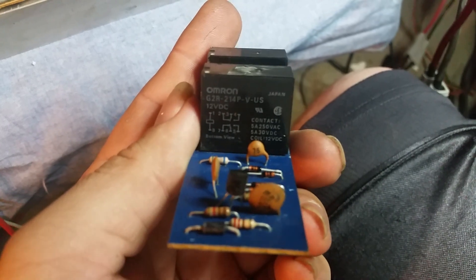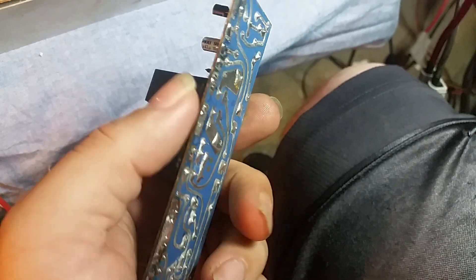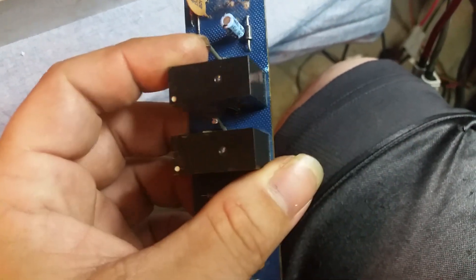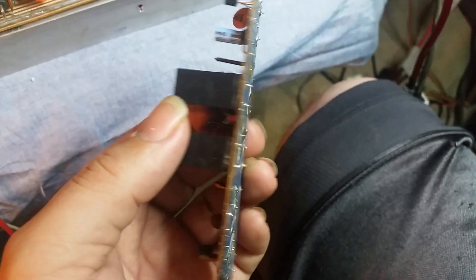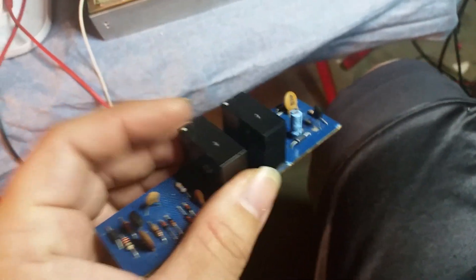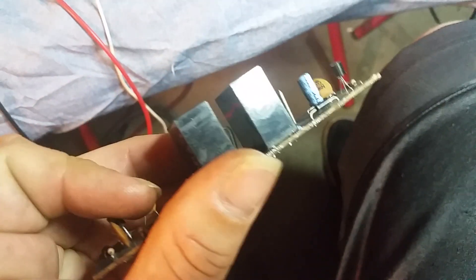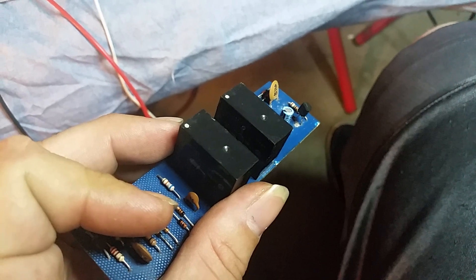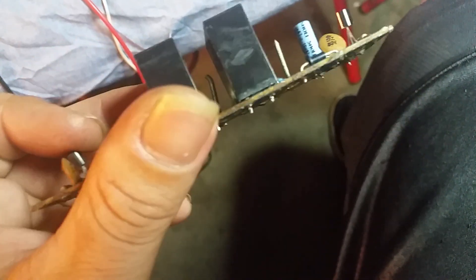By rule of thumb I like to upgrade to the 10 amp when I get anything past the three transistor amp, just to be safe. Instead of just pulling this relay off this board, I would have had to take the board out anyway to replace it. So I thought I might as well go ahead and upgrade the relay. Now this size relay for the preamps is 10 times overkill — you're dealing with microamps at that point, just the electricity coming off your antenna.